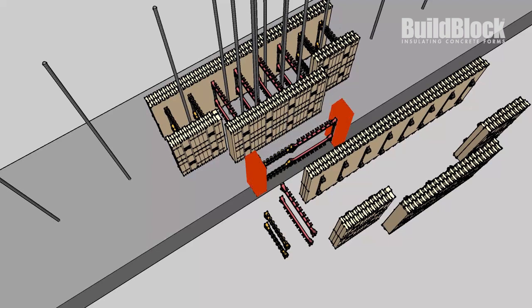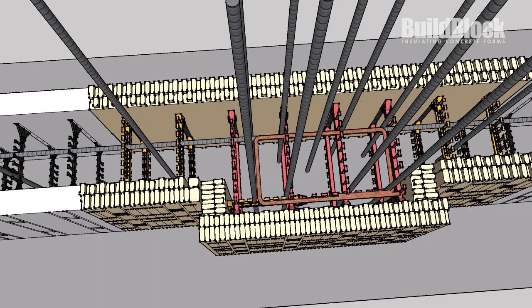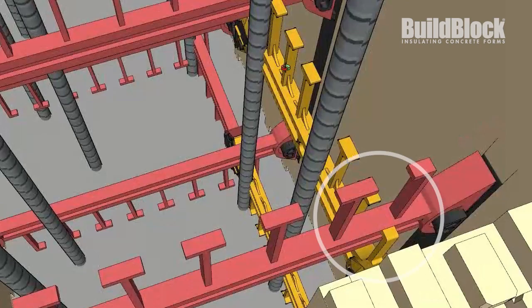Next, we'll cut 2½ inches from the bottom of each of our pieces. This is going to be important in allowing the webs to fit inside of our pilaster. You can see that the webs of our shortened piece will fit underneath the 12-inch webs.